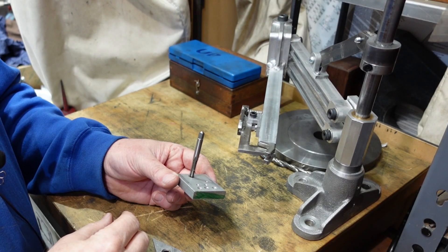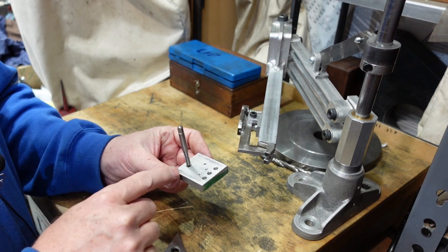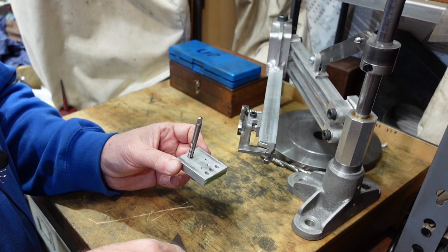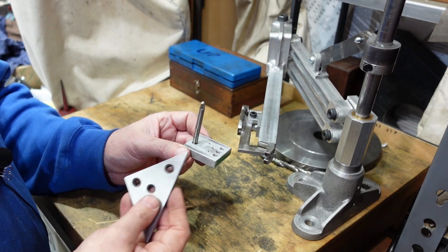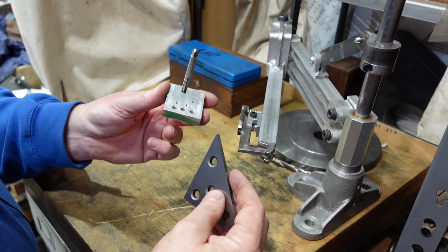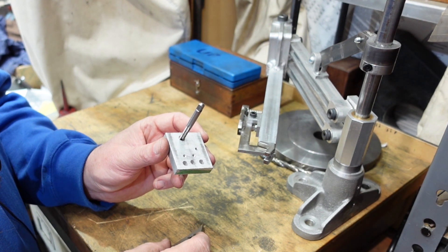My effort to show how square this was in situ — when I looked at it while editing I thought that's not all that flash really. So I've got the same bit of aluminium that I tapped, I've taken the burrs off because that was one of the reasons the square didn't look like it was sitting right. I've put the M6 bottoming tap in there and with my little square you can see that it is actually quite nicely square. So yes, it will tap square. Thanks for watching and we'll see you for the next one.